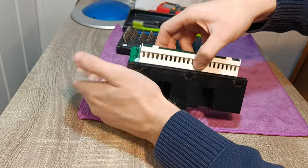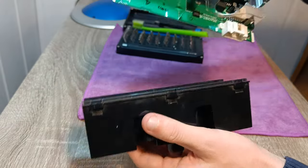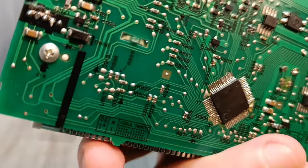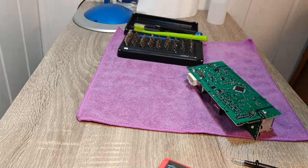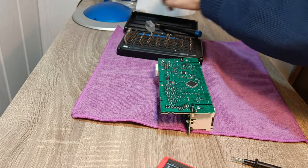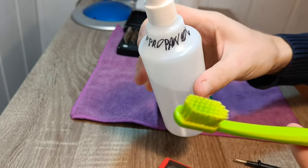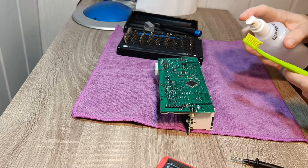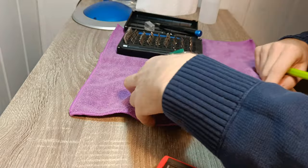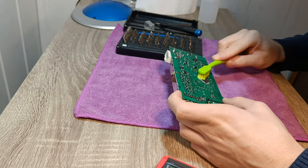The main culprit on those Mitsubishi board computers is a chip on the back of the board. The legs of the chip are from the factory glued with a rubbery yellow glue. I removed that glue carefully with isopropyl alcohol and a toothbrush — but guys, do not wash your teeth with it after using it for cleaning circuit boards.